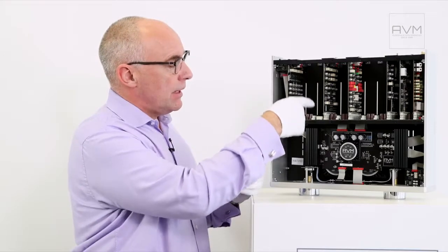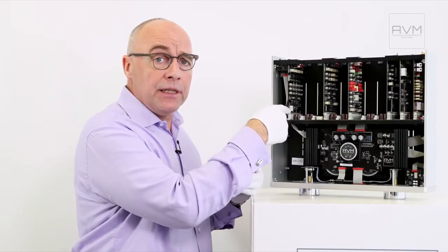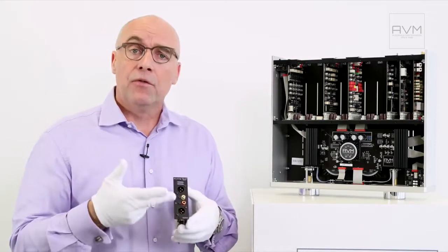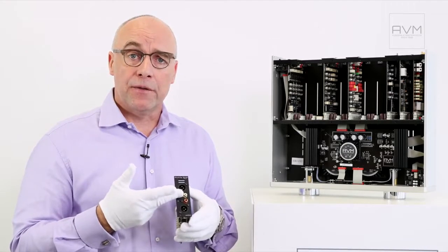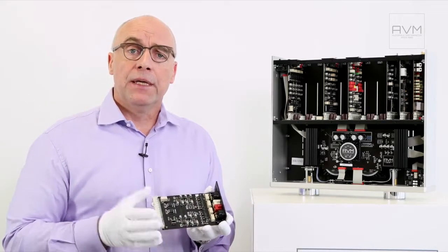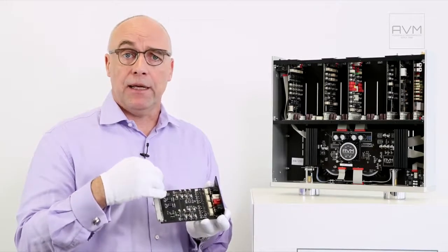The output modules are usually located in this area. You can, as I mentioned before, add 3 individual output modules. For instance, this is the solid state output. Again, 2 outputs that you can use simultaneously, balanced and unbalanced. It's a completely solid state design, and like all the other units, the supply voltages are again stabilized on the modules for a second time again.